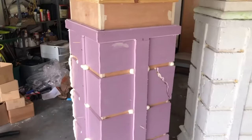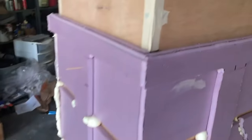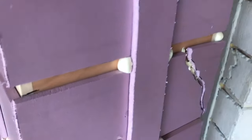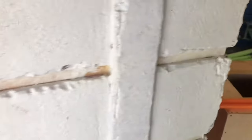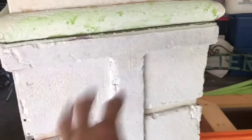I started making the foam molding pieces for the column. For this horizontal piece up here, I used a router table to get that decorative edge and stopped right in the middle so this vertical piece of foam is flushed up against it. I sprayed spray foam in all the grout lines — that will eventually be carved away so it looks like this block is inset into the column, giving you two separate bricks instead of one long piece of foam.